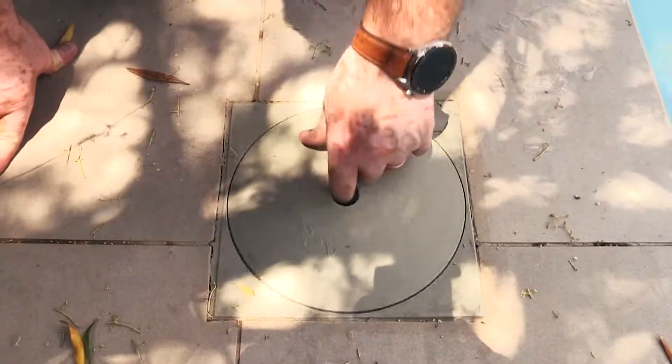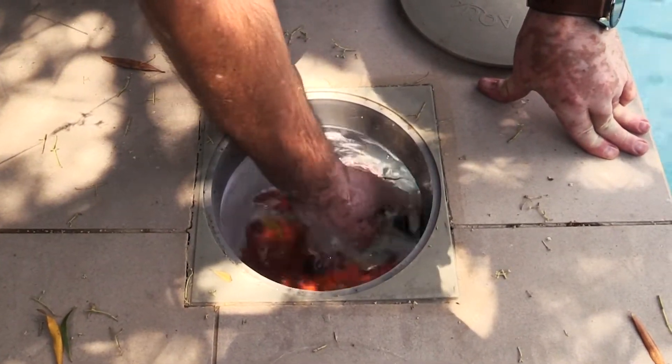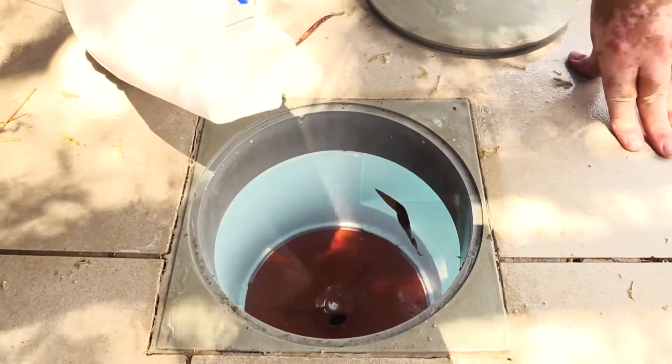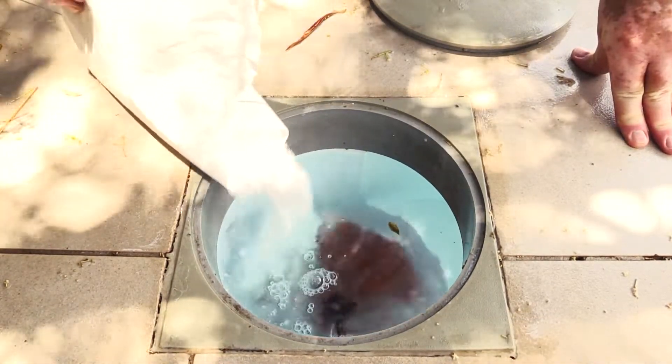How do we do this? We administer the product through our weir, unplugging the pool cleaner. The recipe for this is one kilogram moves 10 parts per million over an average of an hour. So therefore on bypass we would administer one kilogram into the weir each hour until our alkalinity is within range.